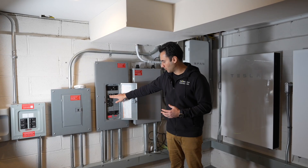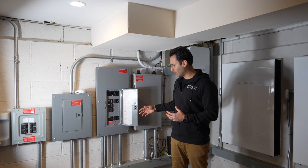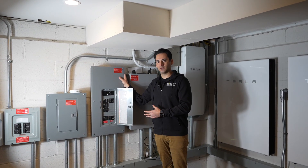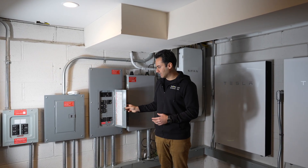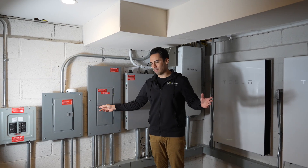There were no issues with adding a 30-amp breaker for our fourth Tesla Powerwall — we have four breakers, one for each. But in some cases you would have to upgrade your panel to add an additional breaker spot for the Powerwall. That was something to consider, but luckily we had enough space here.